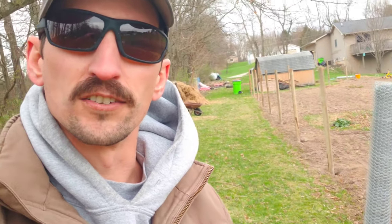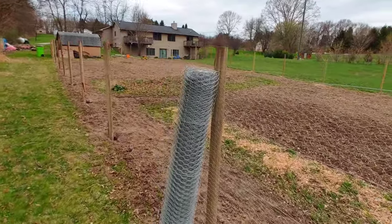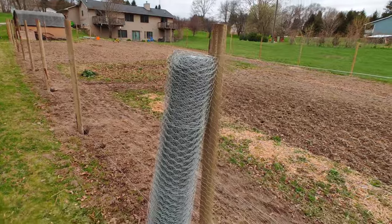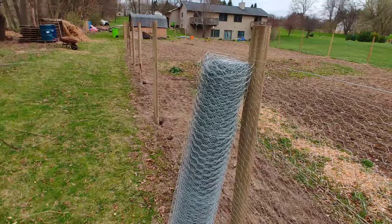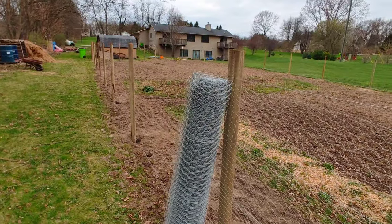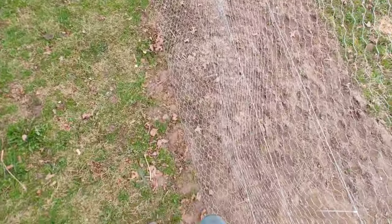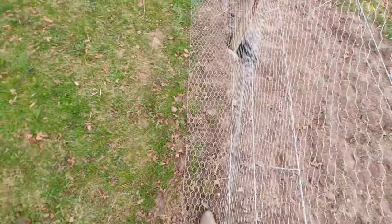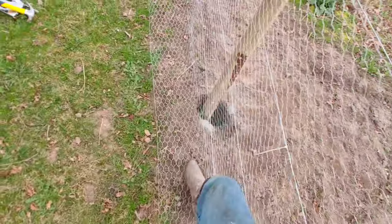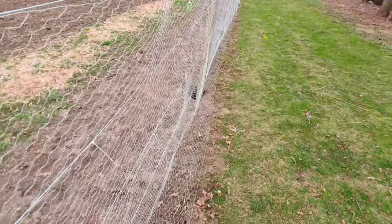Follow this same pattern for the length of the fence until you start hitting higher ground. As you work uphill, the height of your fence is going to start to get taller than where you want the top to be. All you've got to do is kick the bottom out as you go along and follow the same process as on level ground. When you start getting slack on the ground, take your foot and step on it to pull it down — this will actually tighten up the fence as well and get out all the kinks.